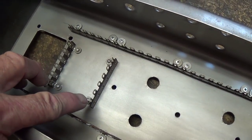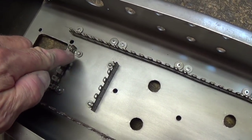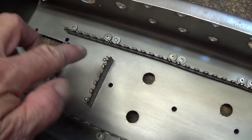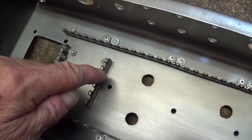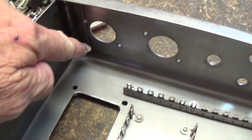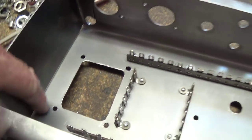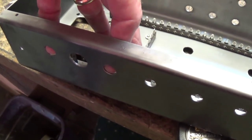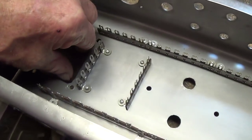Here is where the filter capacitors will be crossways. If you have a capacitor here and here and you need a resistor, it'll just jump from one lug to the next. We also have the hole for the power cord, which will come up this way around to the fuse and switch and then to the transformer.